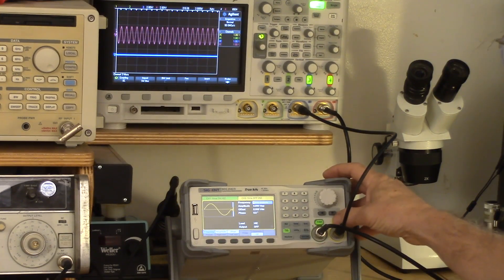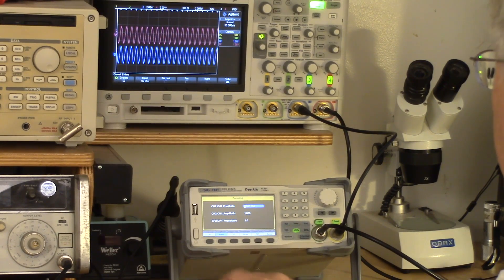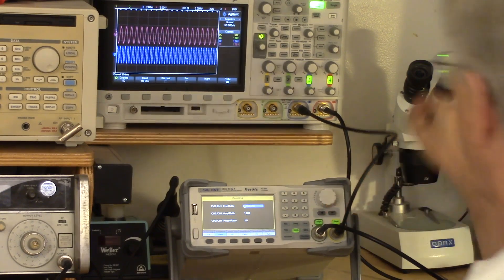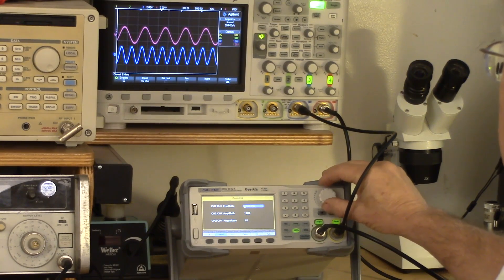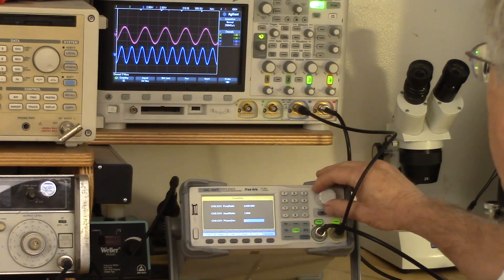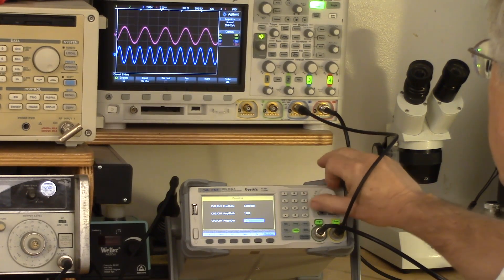I'll go ahead and turn channel 2 on — they're both generating sine waves of the same frequency. What's very cool is that you can actually couple the channels together. With coupling on, channel 2 can be set to sweep at twice the frequency of channel 1, or three times the frequency, or any other multiple you want. The resolution is incredible — down to one part in a million. Or how about coupling based on phase? As I spin the big knob, you can see the blue trace's phase is slowly shifting to the left as we change the relationship of the two sine waves.